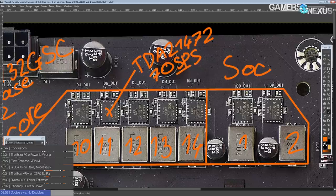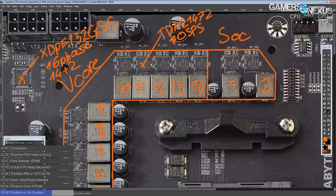The reason why smart power stages are called smart power stages is because unlike normal power stages, they integrate current monitoring, temperature monitoring, overcurrent protection, and over temperature protection. The current monitoring they integrate is actually also more accurate than what you would have on a normal IR power stage. The smart power stages are actually a new power stage standard from Intel for their high-end server platforms — that's what these chips are also designed for.